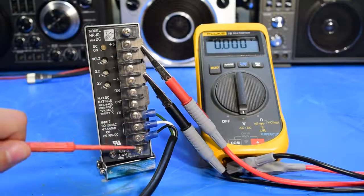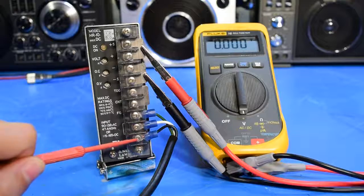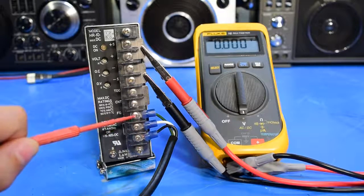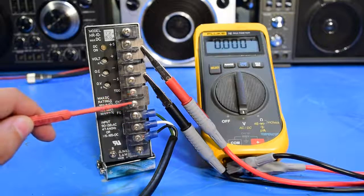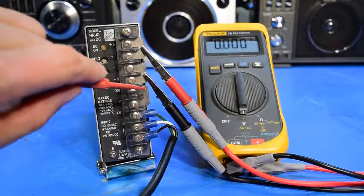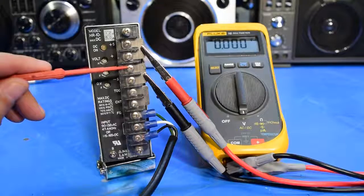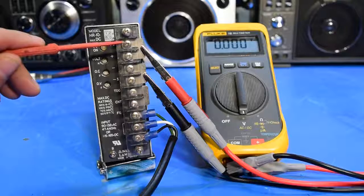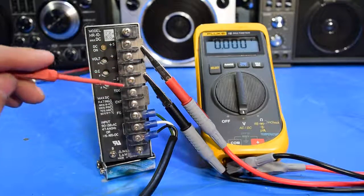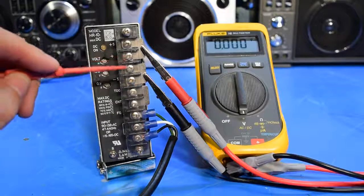Over on the terminal block there's a plexiglass cover covering all of the terminals. These three inputs deal with the AC input — I've got a power cord wired up with fast-on lugs crimped on the wires. These two are for the AC; I don't think it matters which one is hot and which is neutral. These two terminals here are for remote turn-on — you could supply a logic level to turn the unit on, but right now they're shorted together with a jumper bar.